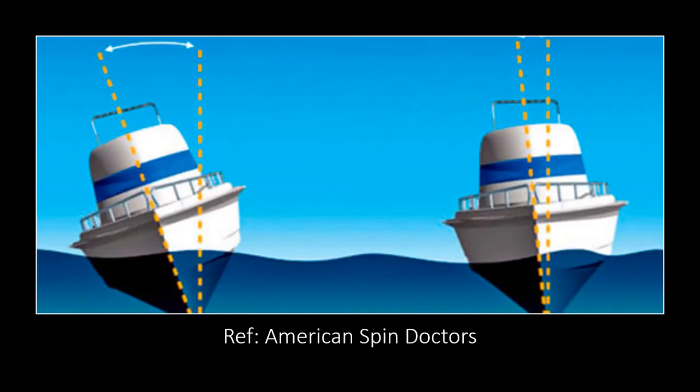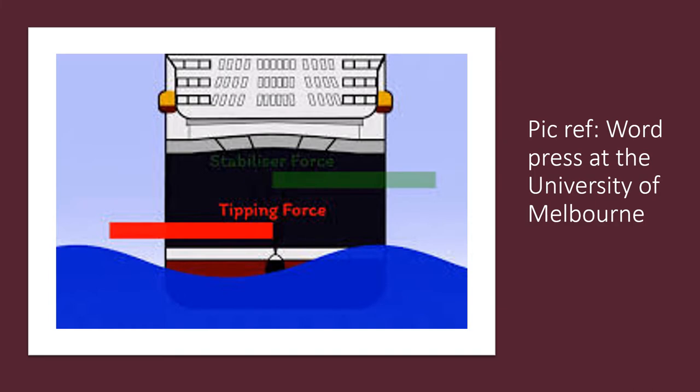As you can see on screen, rolling of a ship during sailing can be reduced by using stabilizing fins by as much as 80 to 90 percent. The velocity of the water stream along the ship's side can be used to reduce the rolling by installing such fins with the configuration of a flap rudder in a sideways direction that protrudes from the bilge keel and which can rotate around a shaft.